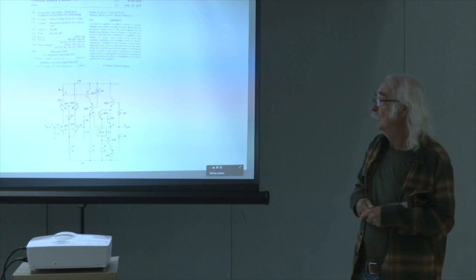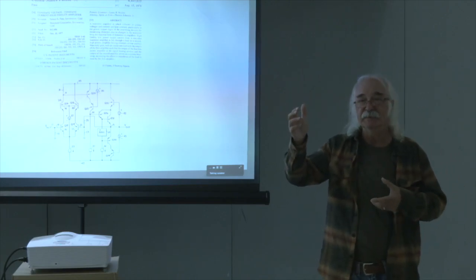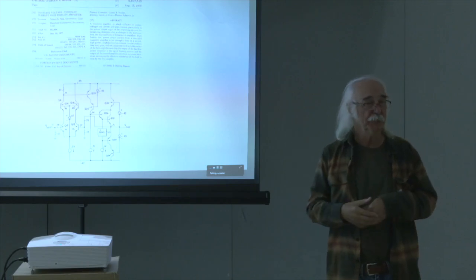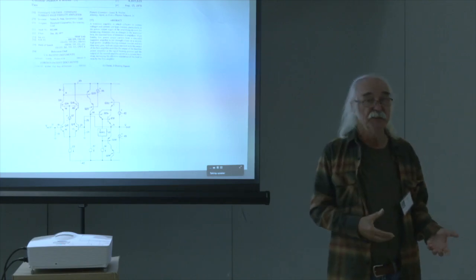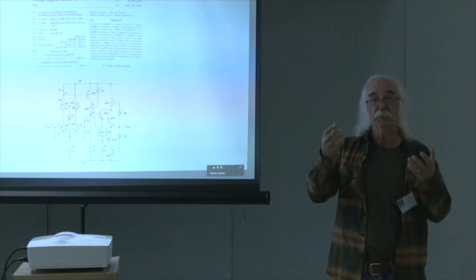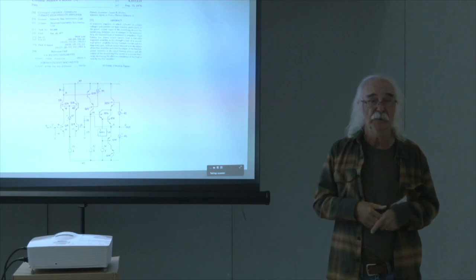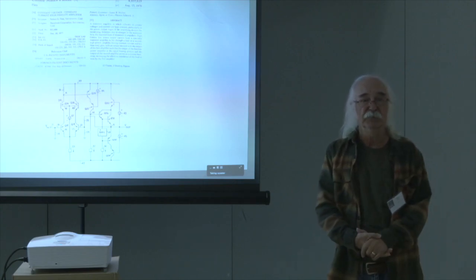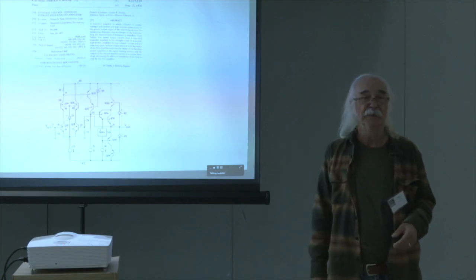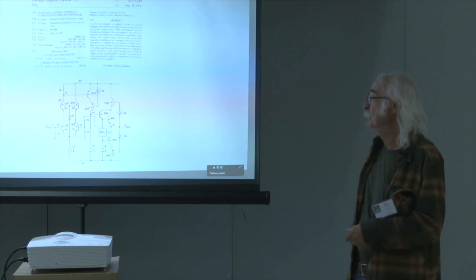Why do we want that? Well, because when the voltage across the device changes, its gain figure changes. And when the amount of current going through the device changes, its gain changes. So to the extent that you can minimize or even freeze these elements, you can take the distortion right out, because the transistor doesn't know it's doing any work at that point.